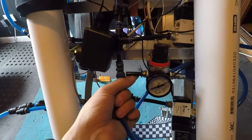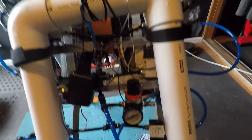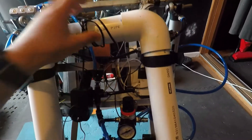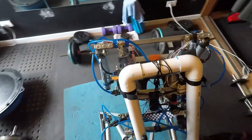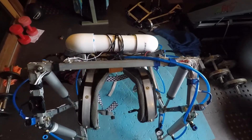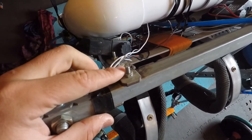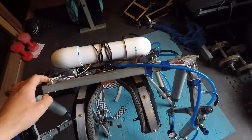At the moment I'm just bypassing the regulator and hooking it directly up to the tank. To power the suit I used to use a LiPo battery, but that's currently in a different state and you can't take LiPos on a plane, so I'm just using a 12-volt transformer. Works alright — just means I have to be tethered. The actual frame of the suit is all 20mm box tubing, welded really poorly together. Initially I was trying to do it without welding, which is why we've got all these brackets with aluminium rivets. These used to be aluminium rivets until the first time I lifted — they actually broke off and the whole shoulder system snapped off the back. So I replaced that with steel, welded it up, a lot more reliable.